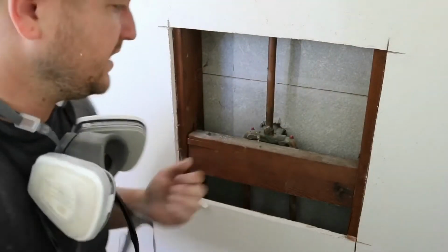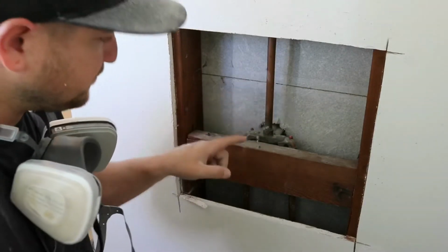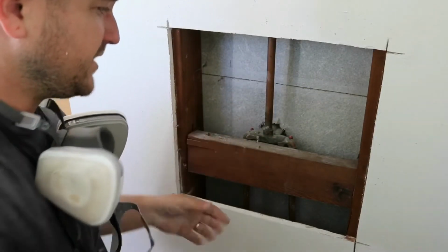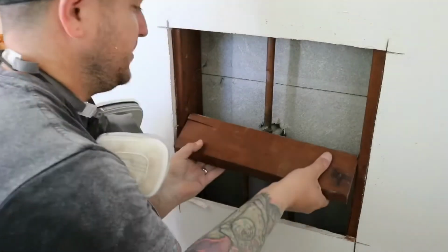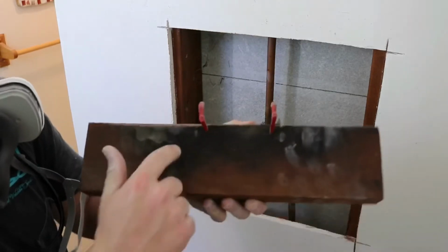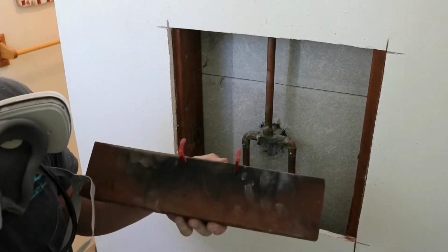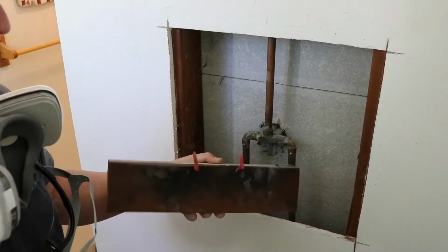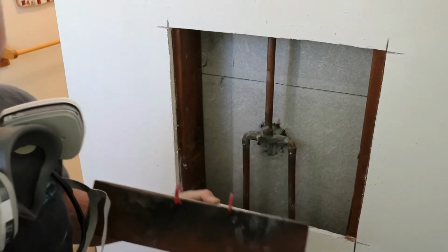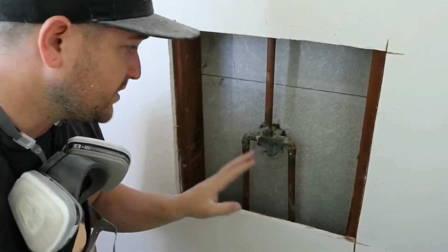So for this, they've got some hangers holding the mixing valve in place. Neat trick to this is just roll the support backwards and it comes right out. Here you can see the burnt spots where they soldered the pipe right onto these hangers. So now I will heat this up with a torch, MAP gas only, and remove it. For this, you just need to apply some heat.